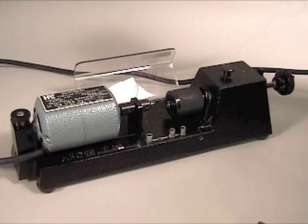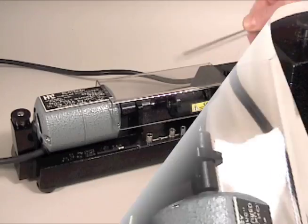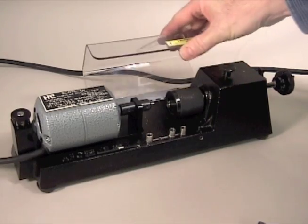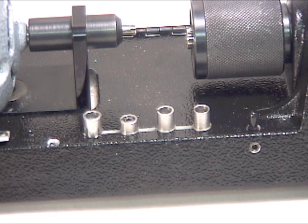The Tubular Duplicode is equipped with a carbide cutter for smooth cutting and a plexiglass shield for added safety. There are 4 different shaft extensions for different sized keys. Number 1 is for small bore keys. Number 2 is for standard keys. Number 3 is for UL pin-within-pin keys. Number 4 is for fort lock thick wall keys.